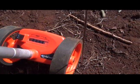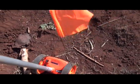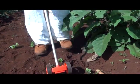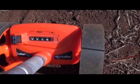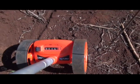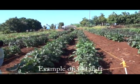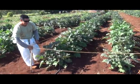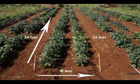You may choose to use an area which is 18.5 feet by 18.5 feet, or in this example we're using 10 feet by 34 feet, which will give us a 340 square foot area. You do not need to use exact dimensions provided in our examples. However, it is important to establish a 340 square foot area, which is 1/128th of an acre. Here you will see an example of what 340 square feet look like. It is important to have some type of measuring device as well as flagging system so you can see the layout of your area. Okay, good.